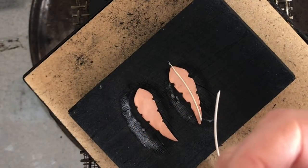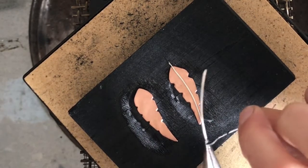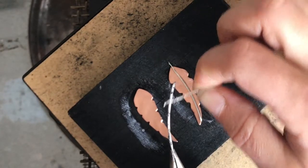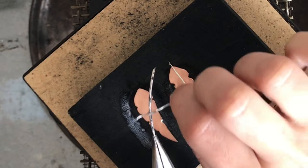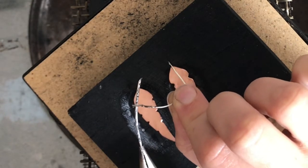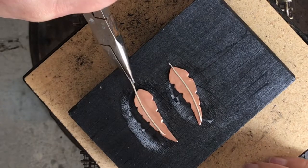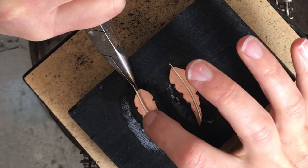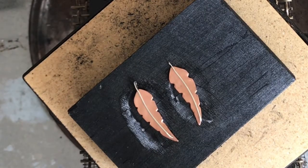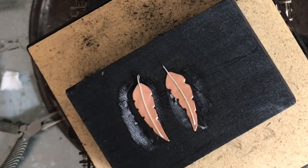Right here I've gotten some of the soldering paste on the wire, and what I'm going to do is just start scraping this off on the bottom part. I want to make sure that I get each end and then kind of space it out — it doesn't have to be absolutely perfect, but you want a very thin layer of paste on here. I'm going to place this and put my finger on the top part just for a split second to get it on there. Mostly I try not to touch it with my fingers, but sometimes your hands just work better.